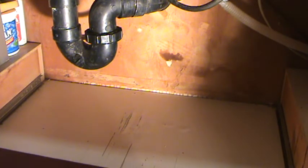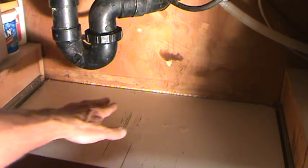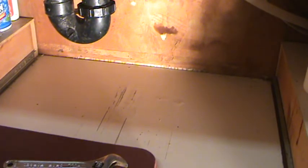Here's another tip: you may think you've got the leak fixed and you saw the water dripping right there, but while you're down there, scope around with your camera or just look around and make sure nothing else is dripping. I had a laugh one time — I went to fix something underneath someone's sink, there was just one leak, but once I got that done, it was dripping somewhere else. And one thing led to another — there were actually six different leaks from six different connections. I had to go to the store for parts a couple of different times.